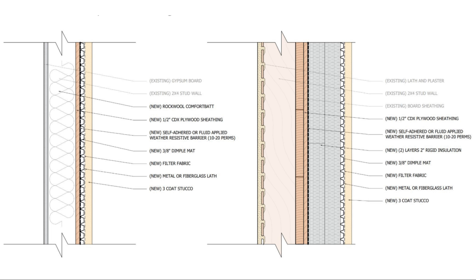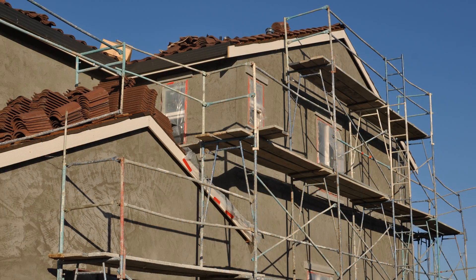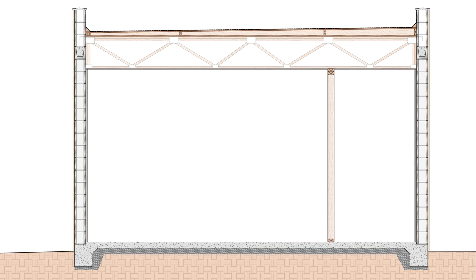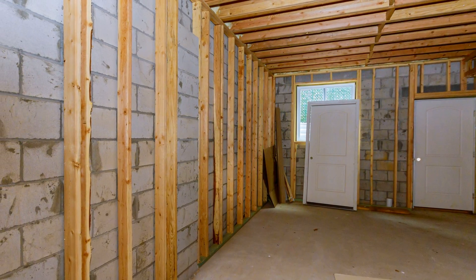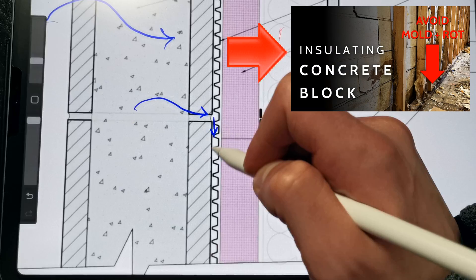Stucco can pose a lot of problems if it's installed on a wood-framed wall without an air gap to promote drainage and a capillary break — we have to uncouple the stucco from the walls if we're planning to insulate. We also see a lot of concrete block or CMU walls in the hot humid south. These CMU walls are either architecturally split-faced blocks left exposed as a design feature, painted, or coated with stucco. It can be quite challenging to retrofit insulation into these wall assemblies because CMU can absorb and store a lot of water, and it doesn't distribute it evenly like a typical mass wall, as water tends to collect at the bottom of the ungrouted cells. We've talked about retrofitting CMU walls in another video called 'Insulating Old Cinderblock Walls the Right Way.'